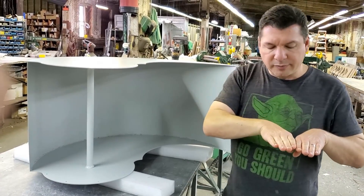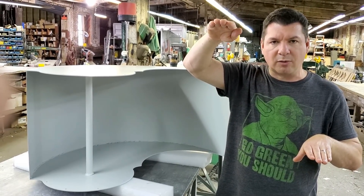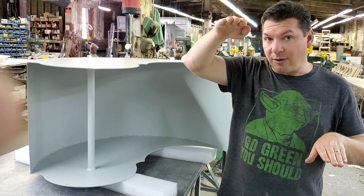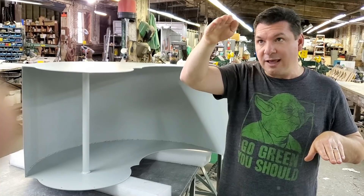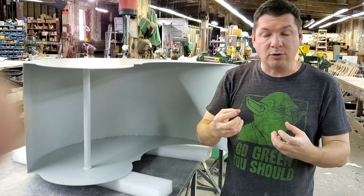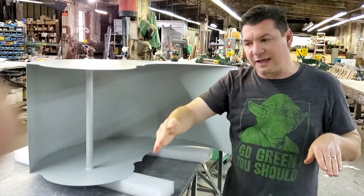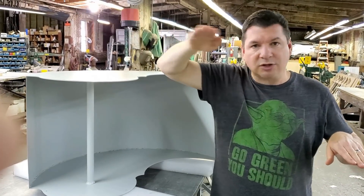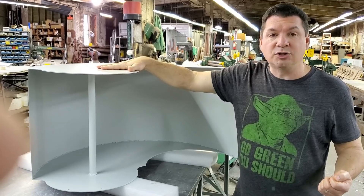With wind turbines right now there's a power curve that goes up as wind rises and hits its peak — say 20 miles per hour — where residential turbines make maximum power. But as soon as you exceed their maximum wind speed, their efficiency drops off drastically because they have to do a dump load or use magnetic or mechanical braking to slow themselves down. That's true whether you're talking a $60,000 unit or whatever. Harmony should go up just like the other turbines, but because of our furling capability it should level off and continue on well into extreme wind ranges.